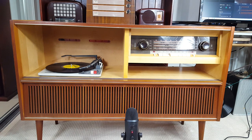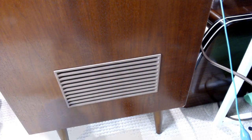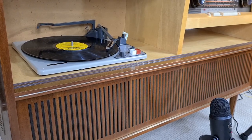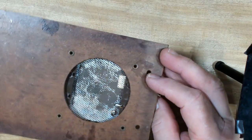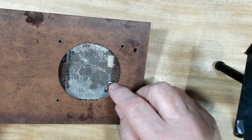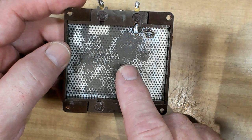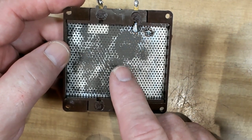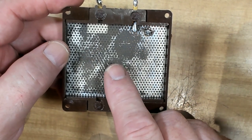But there's another issue - those electrostatic speakers don't work, which is pretty much what I expected. I'll pull one of them out and apart and just see if I can do anything with it. I've taken the electrostatic speaker out - it's mounted on a bit of masonite or hardboard. I'll take these rivets out. My understanding of how these work is it's got a positive plate, a negative plate, and you put your audio signal on top - the little differences make one of the plates vibrate and give you the sound. They're no good for bass, which is why they're used as tweeters.